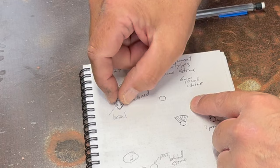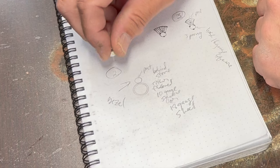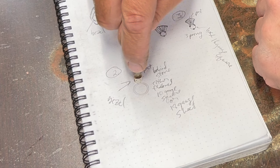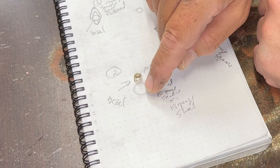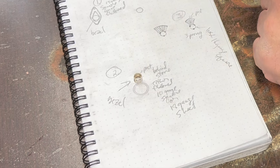The second one is going to be pretty simple. We're going to have bezel right here, and I'll probably put the post right behind the juncture of the two there, and this will just be some 18-gauge sheet, either that or some 10-gauge square that I flatten out with a hammer. I would use my rolling mill to do that, but I broke one of the rollers on my rolling mill. So,